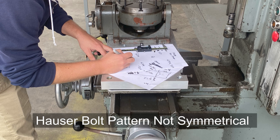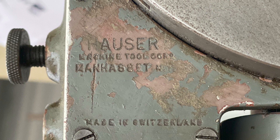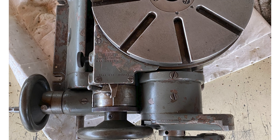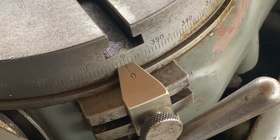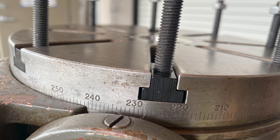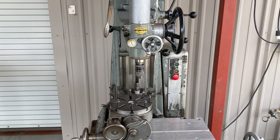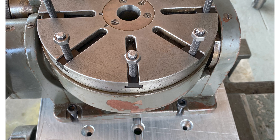The Hauser's bolts are not symmetric and they don't match either bolt pattern, but this is a worthy rotary table. It is Swiss, came through a New York machine tool dealer, and it's nicely put together. There's always some off-angle hole or something we need to drill, so this has been quite useful for us in the past on our old Bridgeport. We're glad to get it back out and put it on another capable machine tool. We've never used collets in it, but I think it takes some sort of Schaublin collets in the middle with a collet holder — if anybody knows about that, let me know. It's going to live on the left side so when you rotate the table to its vertical position you have the table on the right side with some space and all the controls at the front.